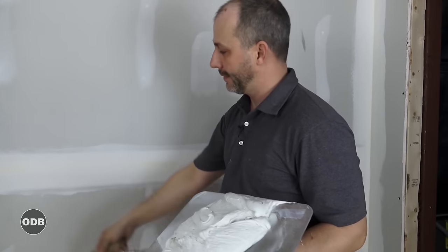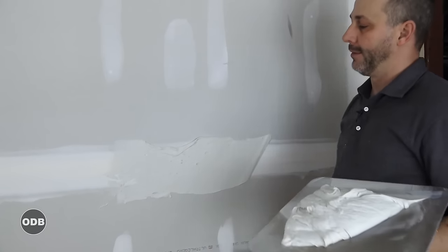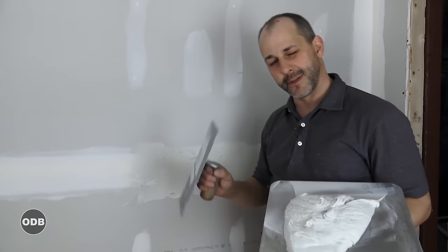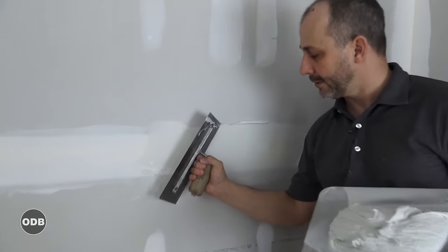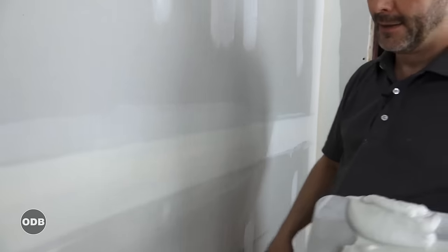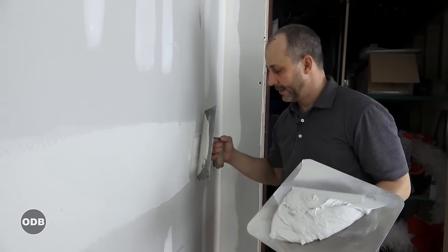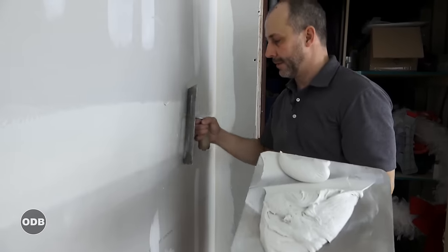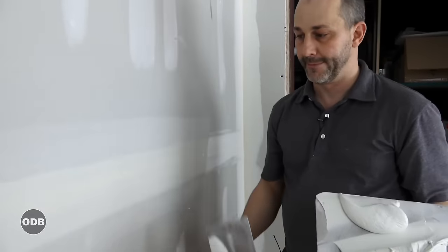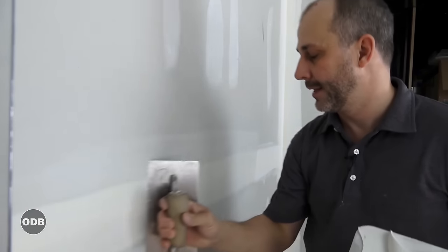I've done my outside corner, I've done my inside corner — now we're going to do the horizontal joints. This is day two, and this is a fill coat day. We're looking at throwing a lot of mud on the wall to fill the coat and then stretching it out just a hair, making sure it's all nice and level. Put pressure on the bottom at a bit of an angle so you're not pouring mud all over the floor. Clean off all the excess, then with a little bit of pressure — top and bottom nice and even — fill it all in. We don't want to see this on second coat. If you can't see the tape, you've used too much mud. The mud is somewhat translucent — when you do it properly, you should be able to see your tape through the mud. You want to see the definition of the tapered joint, and you want to know that you've just filled what's necessary and taken the rest of that mud off the wall.